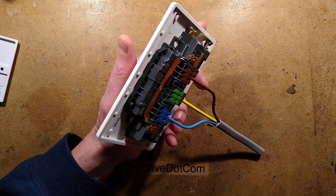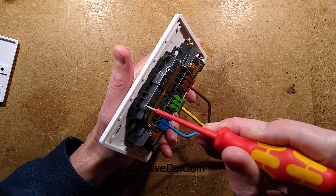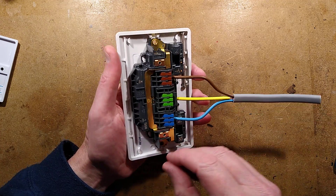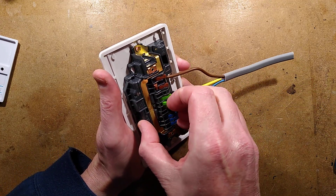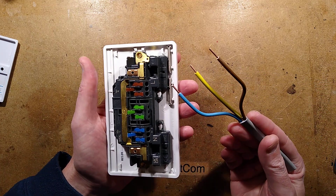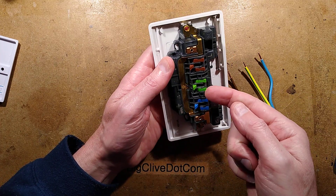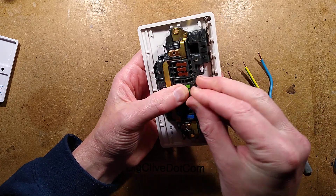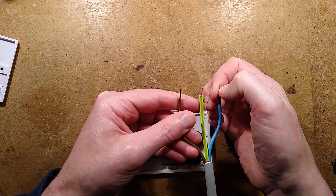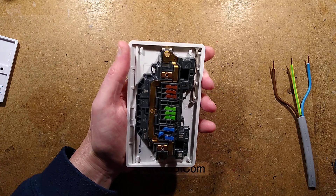It also has the little recessed probing terminals, so you can actually test for connection — for the neutral there, live there — and then you've got the solid brass bar there for the earth. So I thought it would be interesting to actually pop this open and check how it clamps onto the bus bars, presumably inside, if it's similar to the Wago-style connectors. I notice there's this little raised lip here — is it to protect these from being lifted up accidentally, particularly the earth ones? I'm not sure. Or is it because the earth connection has this little sleeve going on it? I can actually see a little bite since I've put those in — it's got the little spring-loaded terminal just like the Wago that has clamped it and pushed it down onto the bus bar.